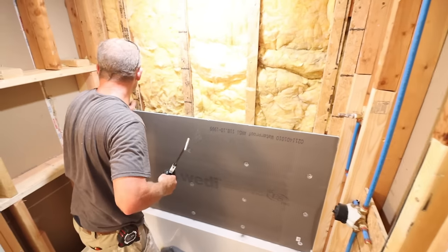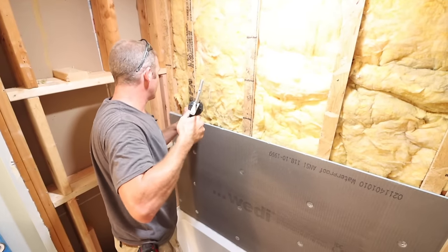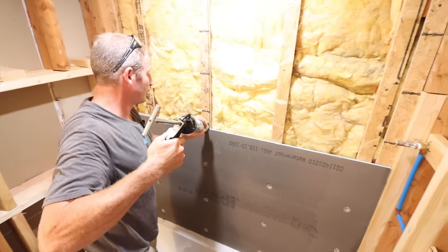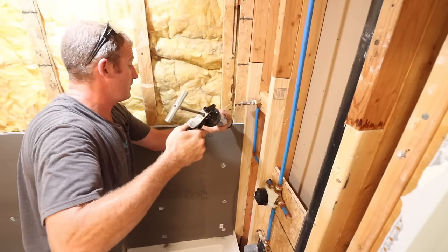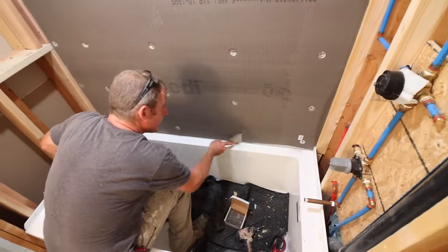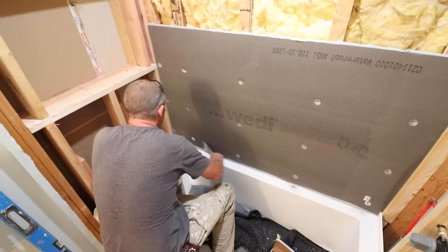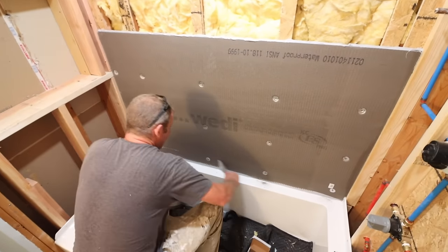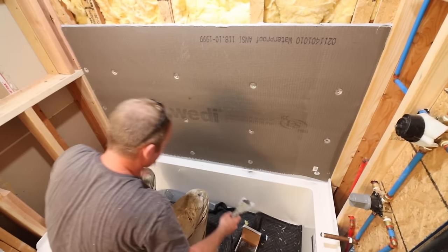On this particular system we need to put a bead of sealant along the top edge of the lower board before setting the second board on top. Any excess sealant at the bottom — use your putty knife to make sure it's all nice and smooth. You don't want a bump-out at the bottom because that's going to cause a problem for your tile work.